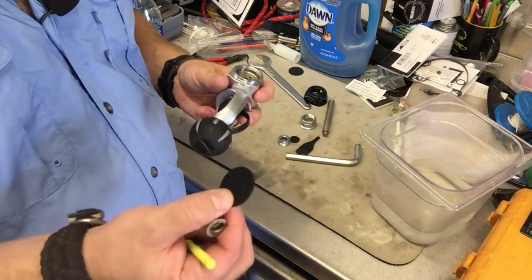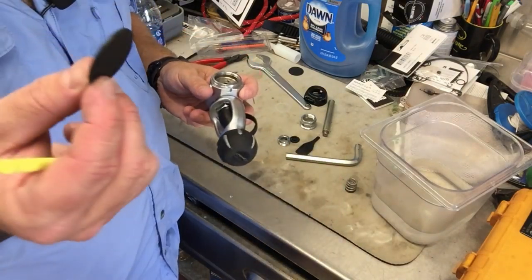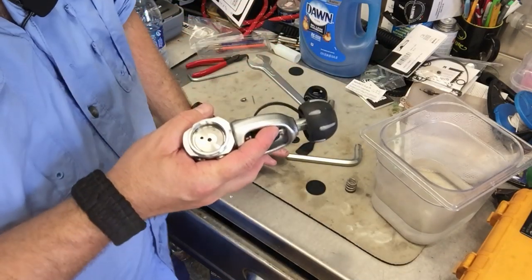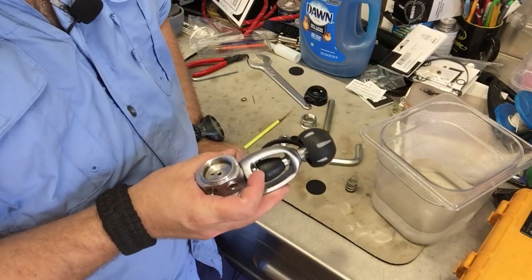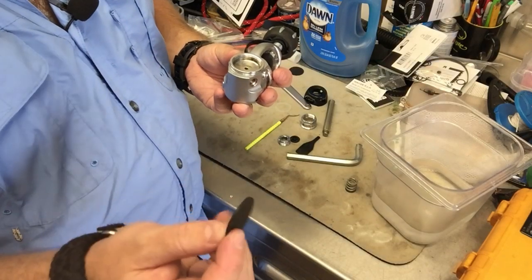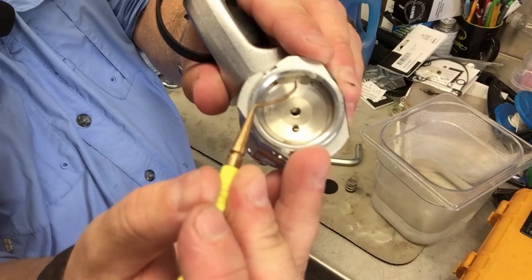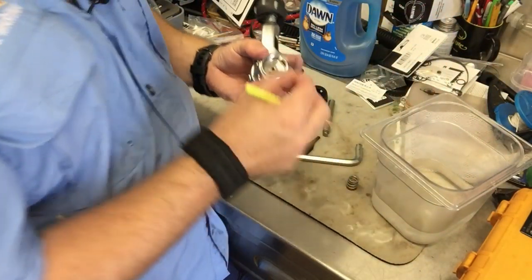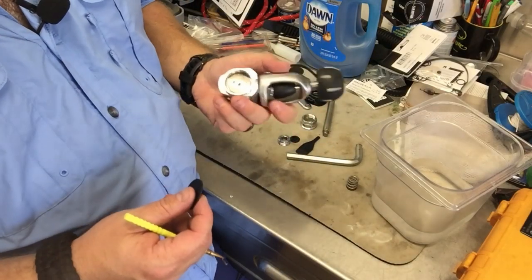For a balanced diaphragm system, IP creep will typically come from one of three things: the spring mechanism used for adjustments, the diaphragm itself, or a housing that either has debris in it or has been scratched. In my opinion, the other shop didn't actually rebuild this regulator — they just took it apart, cleaned it as best they could, and sold it used at a cheaper price. I know this because the diaphragm had never been replaced, and the deteriorated rubber had fused to the inside of the housing, preventing that diaphragm seal and causing the intermediate pressure to never lock in.